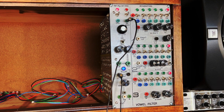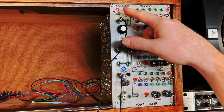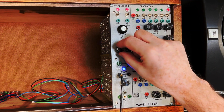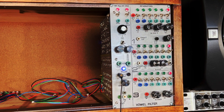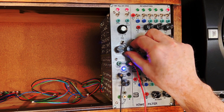The way I have all of my logic inputs on most of my modules is to exclusive-OR them with the switch. So if the switch is up, it actually inverts the gate. I can also select my own voltage input to drive the oscillator — controlling it with the bias knob, or putting a control voltage signal in that can change the frequency of the oscillator directly.